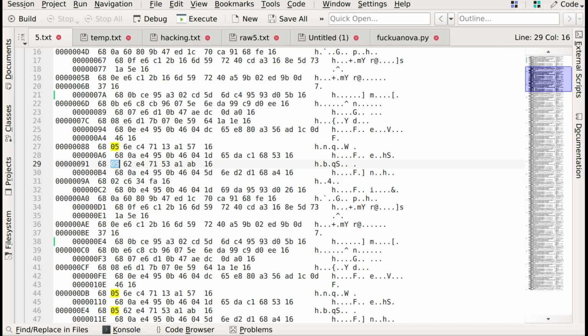And I went through the breakdown basically assuming that that was a command, although it wasn't really relevant for the first part because I was only focused on what I thought was the readback of the current temperature. So given what I thought were the temperature packets, I have 6 bytes that I can't necessarily account for. So I'm just ignoring those bytes, because I don't really know what they are. Now, if I was doing this, there'd be a checksum at the end.